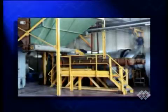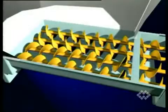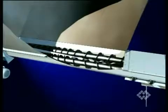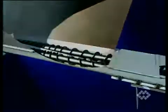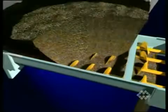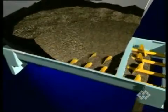Ensure the feeder or bin bottom has been properly supported and solidly fastened. Remove any foreign substances from inside the trough. Ensure the correct direction of screw rotation. If incorrect, reverse the wiring of the electric motor. Before adding material, start the empty feeder or bin bottom and make sure it runs smoothly. Only then add material and proceed with regular operation.